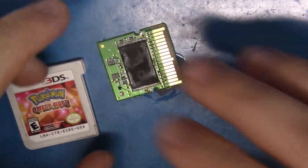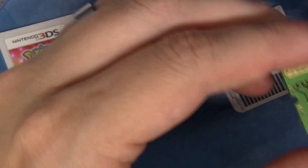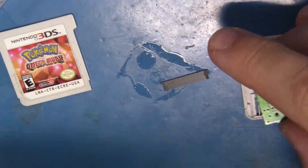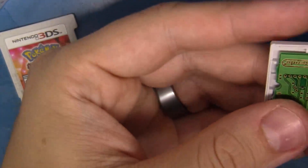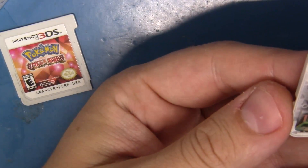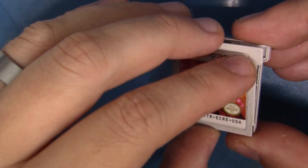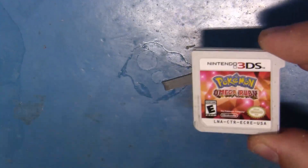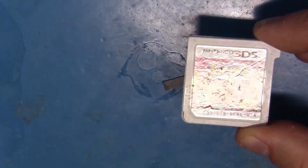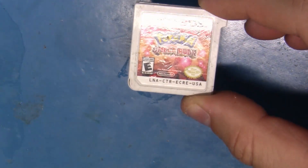That looks pretty exceptional to me. Just like that. Now what I'm going to do is temporarily put our game back together. This game, unbelievably, was not booting before. I might have been totally wrong on this, and if I am, I apologize profusely. I'm not convinced that we're talking about massive memory failure. I think this is a mechanical problem with the solder system used, because these things have to be sold in Europe and other places where leaded solder just isn't acceptable anymore.